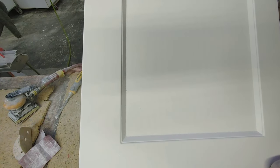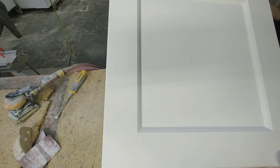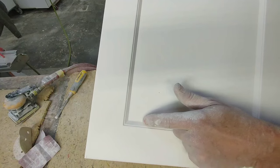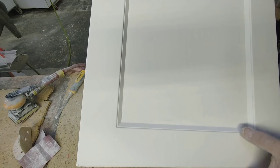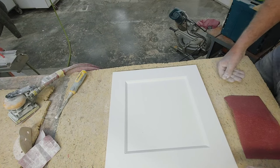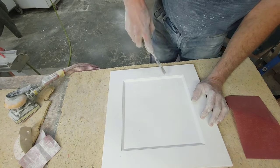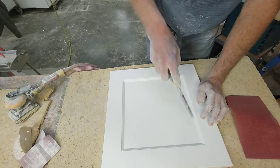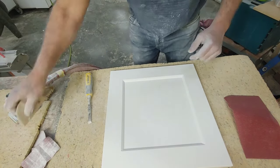So here's the door. It's got primer sprayed on it. I had my supplier — they've got a robotic flat line finishing — spray this. But the reality is I've got to get all of this clean. You can see right here it looks kind of abrasive, just because of all the dust and debris and leftover from the milling and sanding — it just collects. So that all has to come off. There's no easy way to do this properly, so what I do is I just scrape the inside with a chisel. All this does is just break free all those little hang-ups, those little pieces of debris.